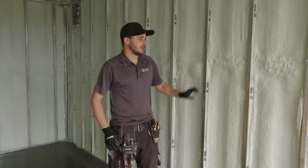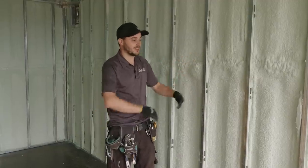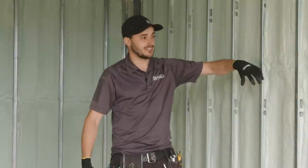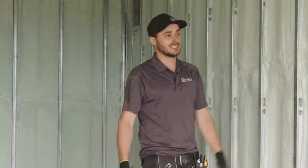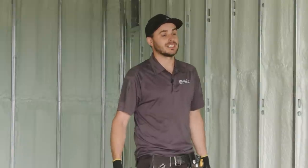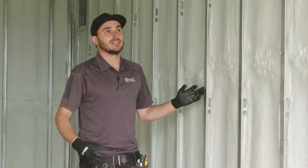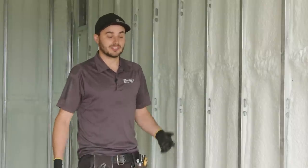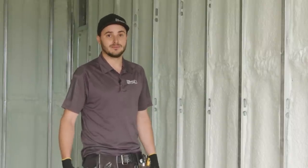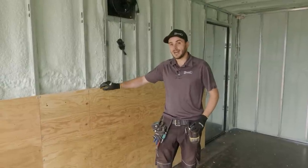The spray foamer's just finished up and cleaned everything up, so we'll jump in here and see how it looks. We've taken the stiffener bars off the wall that we had to keep these things nice and plumb, on the same plane, and make sure they weren't twisting when the foam expanded. This is a 20-foot shipping container — this is what it looks like once it's all steel-studded and spray-foamed. This is going to insulate very well. The next step is to line this container.